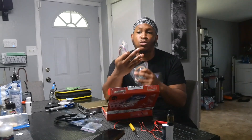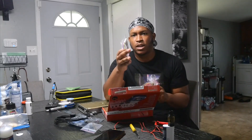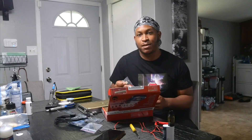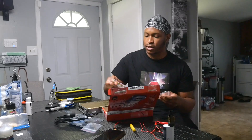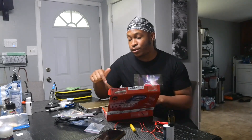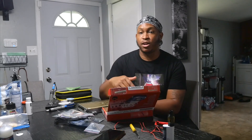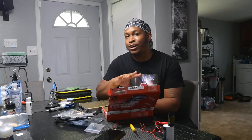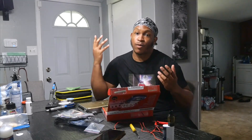Last but not least it comes with two cables. I believe these allow you to run boost control and run a wideband to the ECU — just analog inputs to control other things. I am going to get into that because with the H22A1 using a P28 it would not control the butterfly valves in the intake manifold, so I'll probably be addressing that in the next couple of videos. Mind you, this is not a tutorial at all — I'm just showing y'all me installing this. I'll have all the information I used to figure this out in the description below.